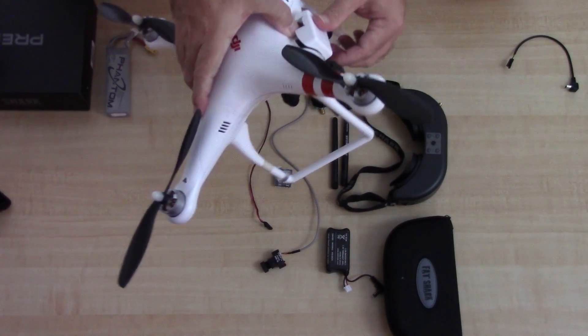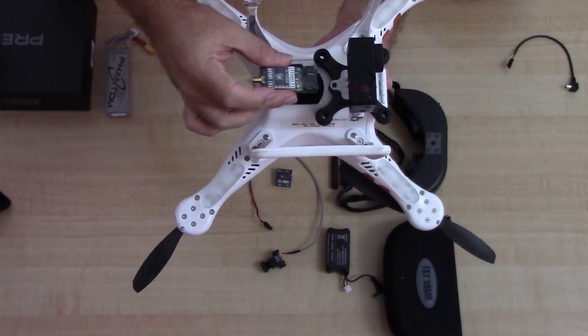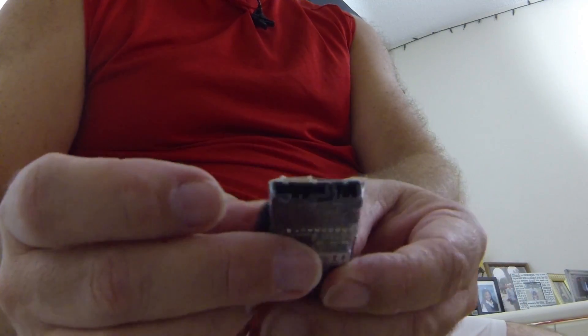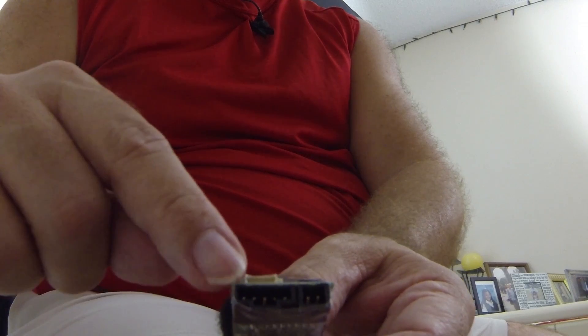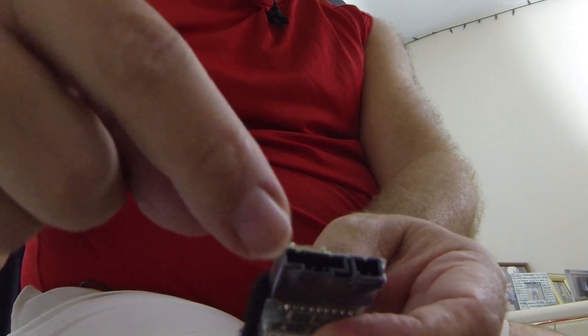I did one side of the velcro here, and the other is gonna go to the belly of the Phantom — just a little piece right there — and then you just stick the transmitter right on there. But before I do that, I'm gonna show you how to hook up the wires. You've basically got two connections: this one is for the onboard camera supplied by the Fat Shark kit, and this is where the power comes in from the battery.